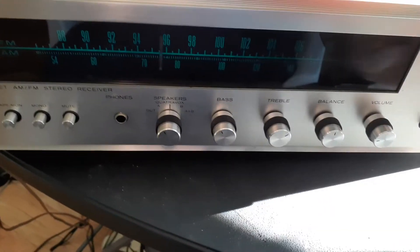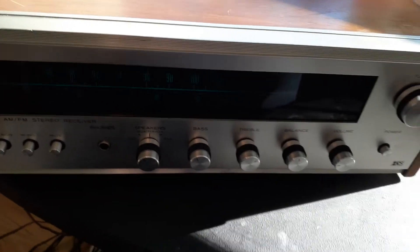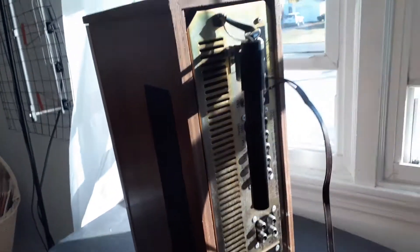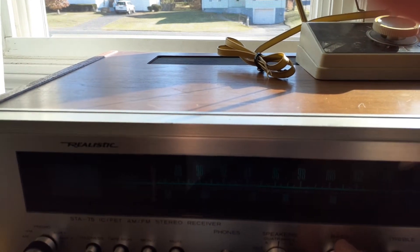Let's put the antenna on. I want to see if I can pause this — let me go down to the other end of the band and put the rabbit ears on it. I'm by the window that faces Springfield. I put the rabbit ears on — these are just a pair of Archer Radio Shack antennas, with the elements for FM, which is about 29 and a half inches on each side. I've got to hook up to the right terminal. The static level definitely got louder when I did that. The signal level is pretty good and we're at the end of the dial.